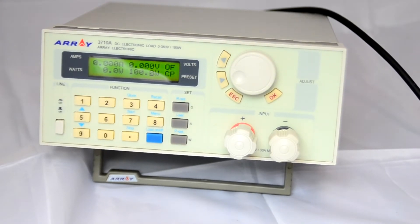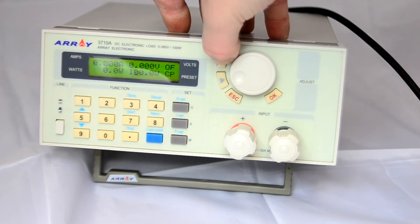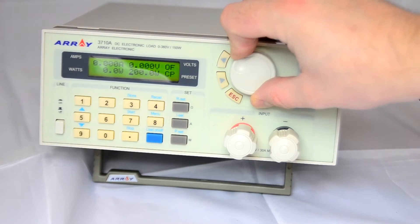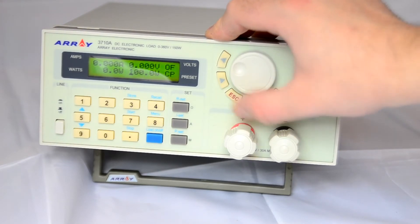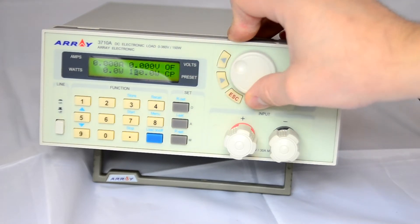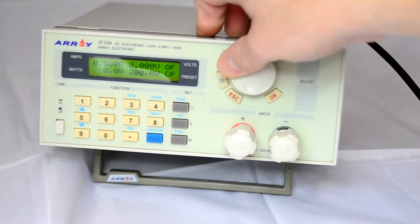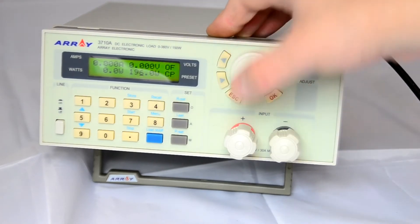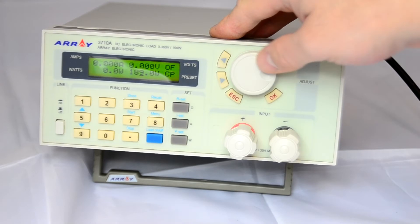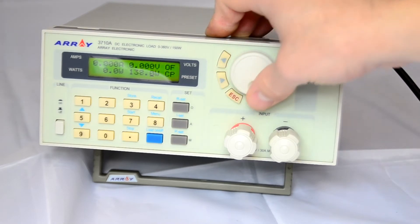After you've set your initial parameters, you can adjust on the fly. You've got these cursor arrows to move the cursor position. Move it right across to the 1s digit and then turn the dial — it goes up to 200. Moving to the second digit, it's as simple as that: move it to the digit you want and turn it up and down. It doesn't just loop back around to zero either — if you're at 196 and go below 190, it goes to 189, which is quite nice. So you can adjust in 1-watt increments or 0.1-watt increments.